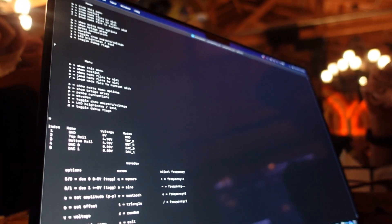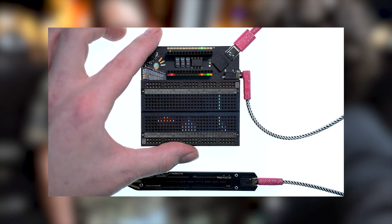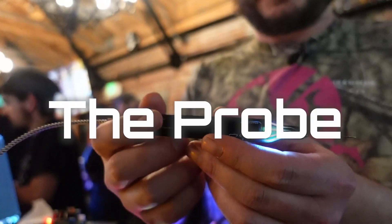You can also emulate 32 USB devices if you wanted to. We've been so deep in the weeds with USB endpoints and how USB full speed works — we're getting close to using all 12 megabits per second. One endpoint is a Python REPL, so you can send it any Python code and it will run it with a set of functions saying connect that to that. It's also a gaming platform — it's 14 by 30, and at that resolution all first person shooters look the same. There's a gun and walls and you shoot stuff.